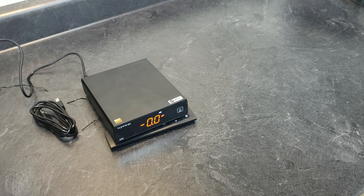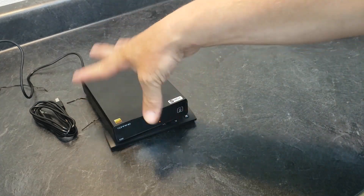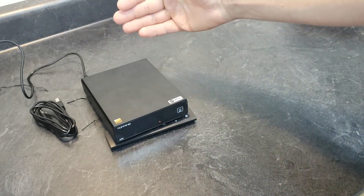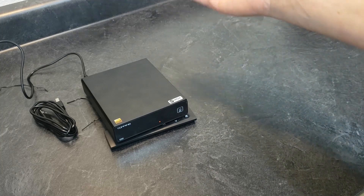Next-gen specs: they've pushed distortion all the way down to 0.00009% THD, and a dynamic range of 126 dB, which is just incredible. On the other side, to achieve full 24-bit dynamic range you'd need 144 dB. A lot of these DACs that say they support 24-bit or 32-bit — that doesn't mean they can output that much dynamic range in the analog signal. They can decode 24-bit and 32-bit files, and even if you have 24-bit files this will decode them.